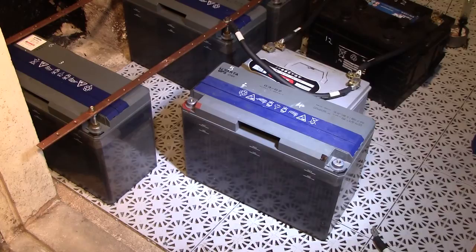So, now that the battery has been shaken, I'm reasonably certain that it's safe to take all the caps off. I'm now going to do a specific gravity measurement on this battery in order to see if some particular cell has been weak or shorted and would cause excessive gassing of any of the others, because the only mechanism by which a lead acid battery can make its electrolyte level rise is by forming gas or having some foreign object introduced into these cells, which is not the case here. I'm very perplexed as to what's happened here. I was not expecting anything of this nature to ever happen to my bank, since it is reasonably well cared for.